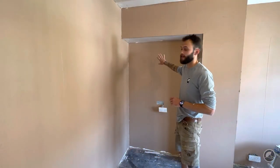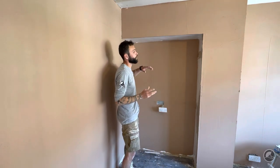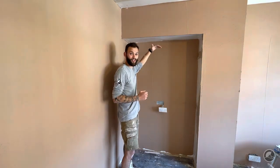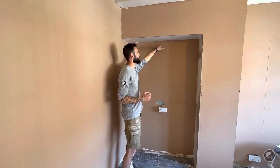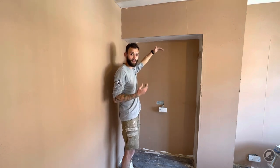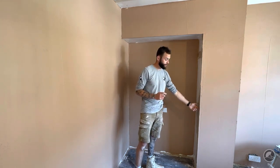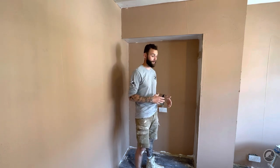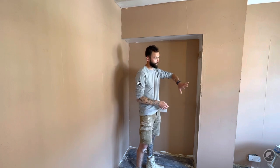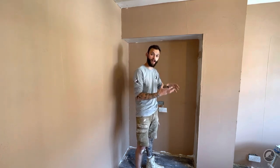I've plastered inside this alcove but left the top and the side. This section here is actually really wavy. If I was to plaster both sides at once, it's a lot harder to get it straight when you're doing a wet corner — in areas where it's really low it's going to be really thick. So I want to plaster one side, let it go off, and then plaster the other side, making it a lot easier to see where it's straight. Similarly, this corner was pretty badly damaged — the homeowner's done his best to repair it but there's probably a 5-6mm gap behind this bead. If I skimmed this side first it would end up twisting the bead. So I've done the face first; that will go off and hold the bead in place, so when I come to plaster this side the bead is nice and firm and I don't have to worry about it twisting.